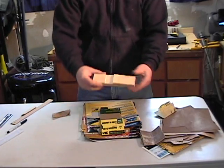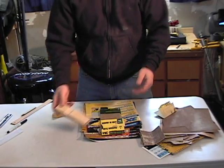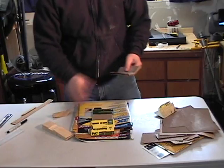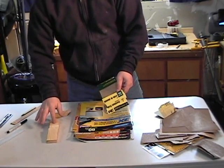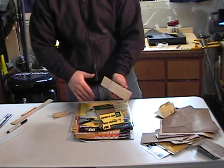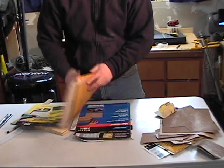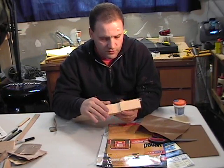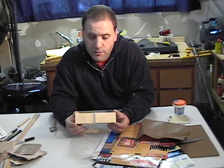Now it's time to sand. We have the design cut and it's fairly smooth from using the files and the rasp. There are two different types of sandpaper: 40 grit, very coarse — I'm not going to use it because the surface is already smoother than the 40 would handle. Next I have 60 grit, good for really smoothing out some of the lines left from the rasp. I'll probably use that, then 80, then going into 150, 220, and a 400 for a very smooth finish. I've gone ahead and finished with the 150 and it has a really nice smooth finish. If you enjoyed this video, go ahead and click like and subscribe to my channel so you'll get notices when I post my other videos for making the Pinewood Derby.